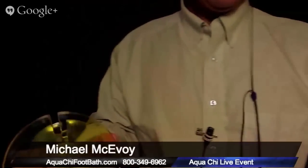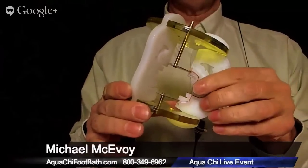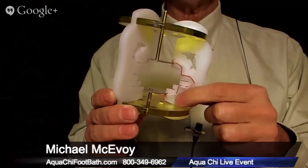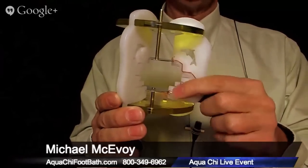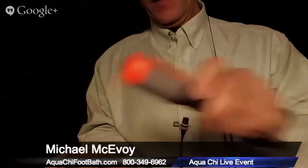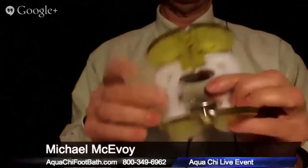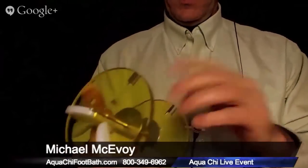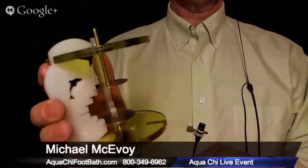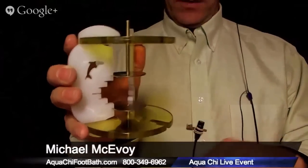Alright, now we've got both well seated. I am going to give that a tap using a screwdriver. I'm going to double check — you can see now that the top and bottom are seated in this white leg with the copper strip. This is important because this is what carries the connection through the module. Tapping that silver disc against the white leg so it's sitting nicely. By doing it this way, there's no confusion about which leg goes back where, because you've only taken one out entirely.